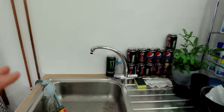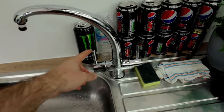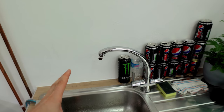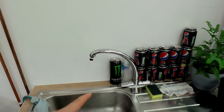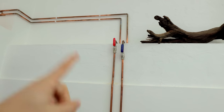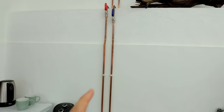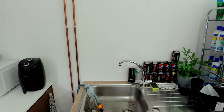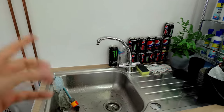So in my previous studio, I had the tap set up so that I had the right mix of hot and cold, and I could put it straight into the tank, add some dechlorinator and whatnot as well. It's a little bit different in this one. So here is the sink area. Now the pressure for a start, because we're on a lower level, is so high, it pretty much just blasts out way too quickly. Also, this is all quite new, all the plumbing system for the hot and cold. It takes so long for the hot to come that the back pressure of the cold, if they're running both together, just keeps making it fluctuate up and down. Can't have that with fish and water going in.